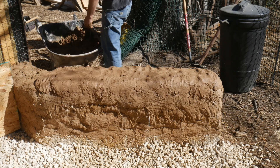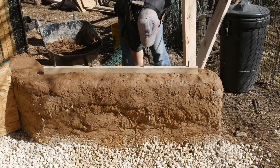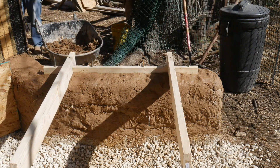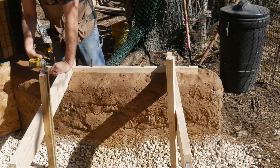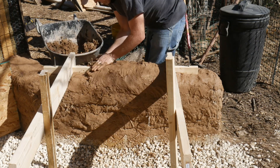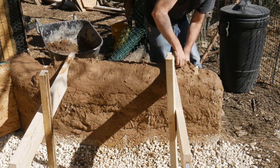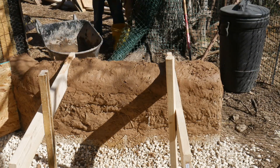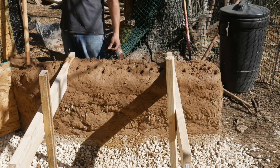As I went up, I gradually sloped the wall towards the berm. At 2 to 3 feet up, I installed a dead man tie-back in the wall. This consisted of a 2x4 anchored to the wall with several pieces of rebar. I notched two more boards so one end fit around the 2x4. One end of each board is fastened to the 2x4 and the other end extends into the berm, so that the weight of the berm will reinforce the wall. I also put dead men in the end of the walls to provide an attachment point for a possible future fence.